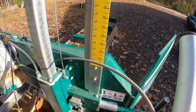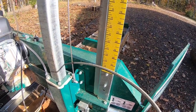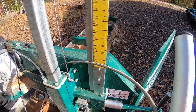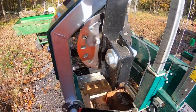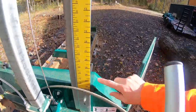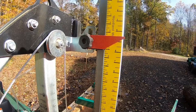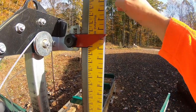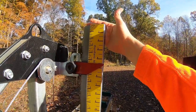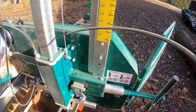If I need a precise measurement, I mark it on the cant and put the blade against it and cut it. The other thing is my production runs of these 8-inch siding boards that I'm making come out perfect at 3 complete revolutions of that crank, which comes out at 7/8. So I'm going to take this off because right here it's not too bad. But when this mill is up, which a lot of times it is when I cover it with a tarp, that tarp is starting to get cut by this edge. So like I said, there's probably a lot of other ways around it, but I'm just going to take this off and store it in case I ever decide to want to mess with it again.